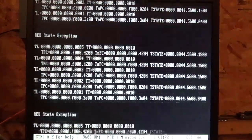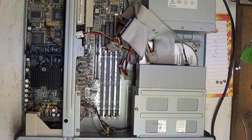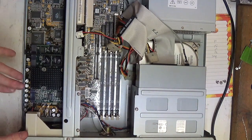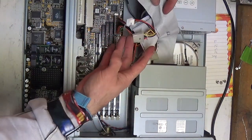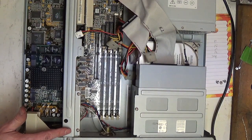Okie dokes. So, definitely not RAM. So it's either the CPU or the mainboard. Let's switch out the CPU. We have the guts of our Ultra 5. CPU, you can see there's no RAM. Hard disk is present. CD-ROM drive is present, but both are unplugged. The quad fast Ethernet card, which would go here, is removed.